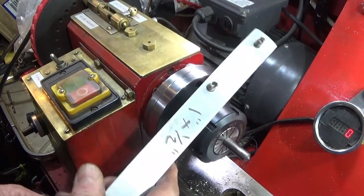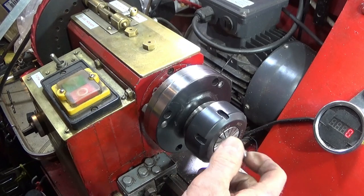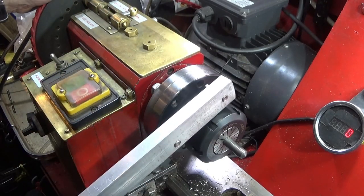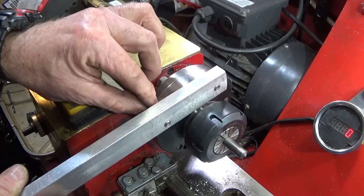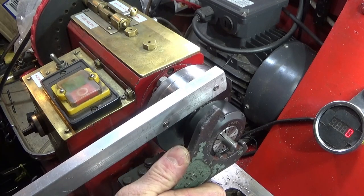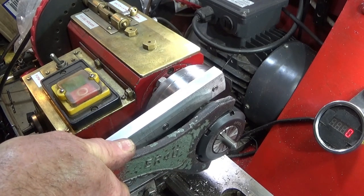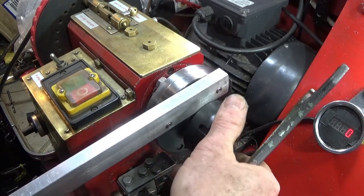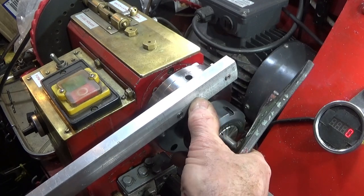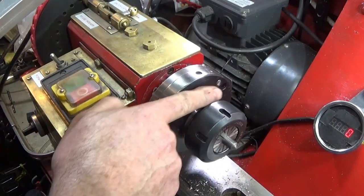This is the finished handle I've made up out of a piece of one inch by half inch aluminium, with two holes drilled in there. On both the ER32 and ER40 collet chuck there are four spare holes around the face, so I've made it so that the pin can fit into one of those. The other pin rests on the diameter for locking up the chuck. I can lock that up nice and tight, and I can also loosen it off easily by locating the back pin in the hole and the front pin on the diameter. The handle doesn't touch the thread.